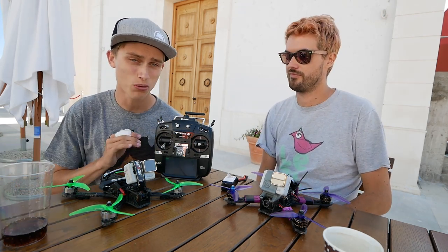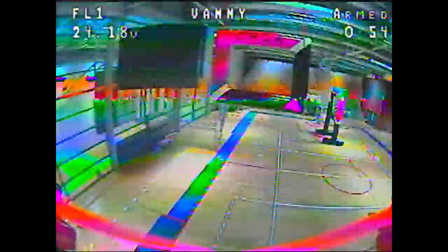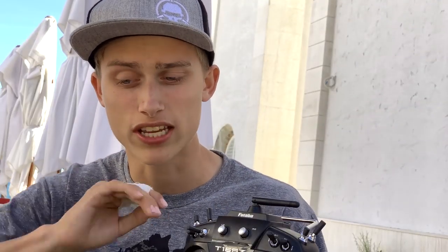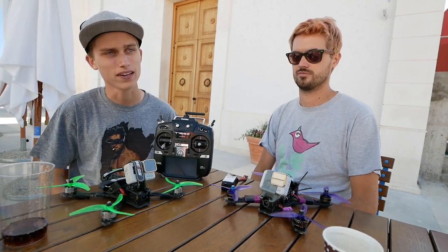Managing your video channels when flying with others is paramount, especially in racing where sometimes eight quads are in the air. In the pits, it's a big no-no to just plug in your quad. If you're going to do it, make sure your video transmitter is unplugged or has a pit switch, because it can cause something very bad — you could be flying, I plug in, you see my video, you disarm and fly into a house, or worse, hit someone. If you're not sure, just don't do it.